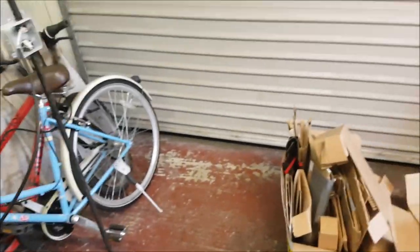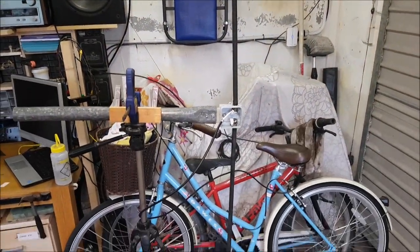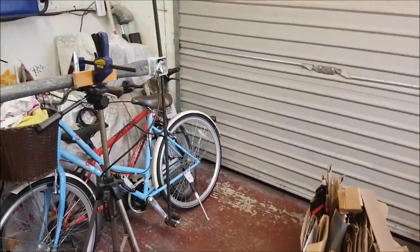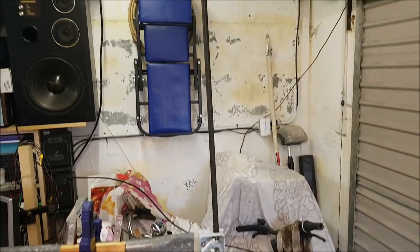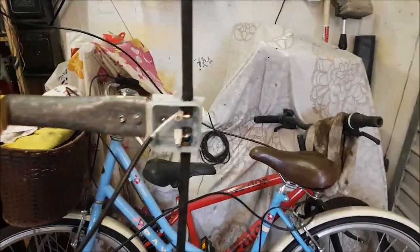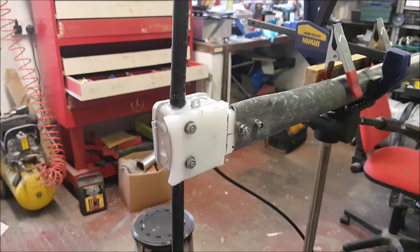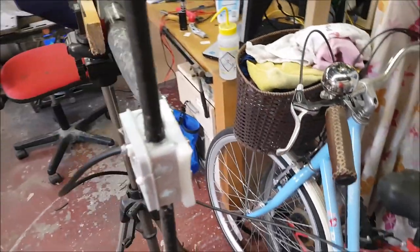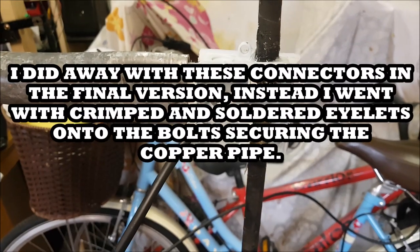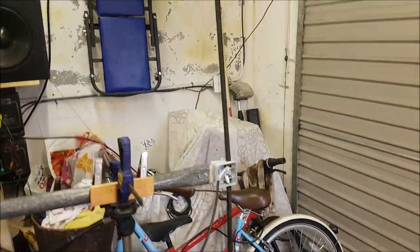Basically it is a half-wave dipole, vertically polarized. It's always been a bit dodgy to get FM reception here — I don't know what the deal is — but I'm hoping with this thing it'll be a bit better. Very, very simple to make, and made out of half-inch copper pipe, black tape, a junction box, a bit of a chopping board. The end of the pipe is squished in, all stainless bolts, silicone around where the pipes go in, and a couple of connectors where they attach onto the pipes inside.